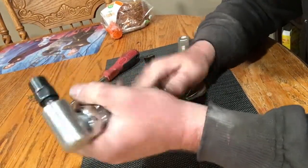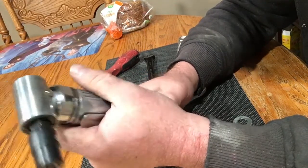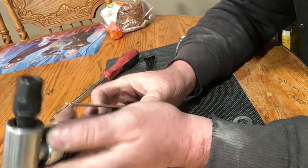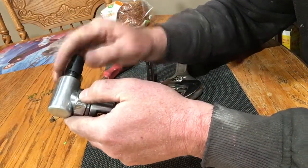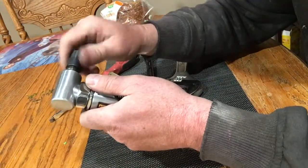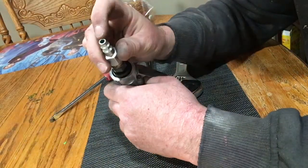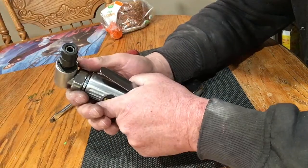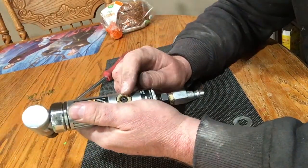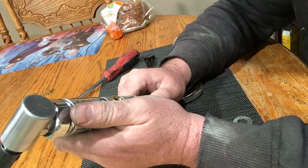This is one of the big culprits in these things not working — it's the connection between these two gears. So if you'll take that apart and grease it up real good manually, it should work fine. And that's one of the big problems with the Central Pneumatic grinder. I can feel that it's working right now — it just needs some grease in there. Just a can of bearing grease, dip the head in and swirl it around. Make sure that it is contacted and the gears aren't conflicted. The bottom part's air inlet will be lubricated by the oil that you put in here. Also if there's some air slippage out of this valve here, you could put some grease on the inside on those O-rings we saw earlier and it would probably fix it.